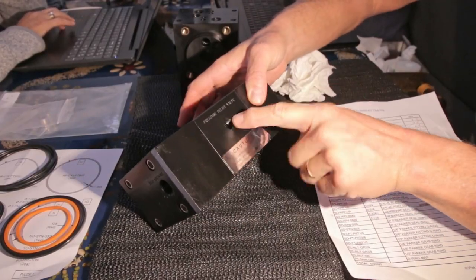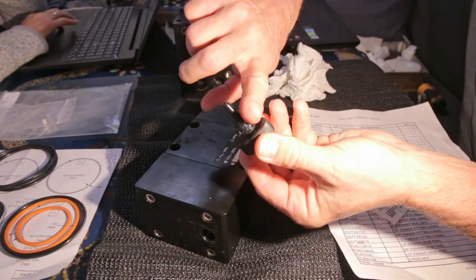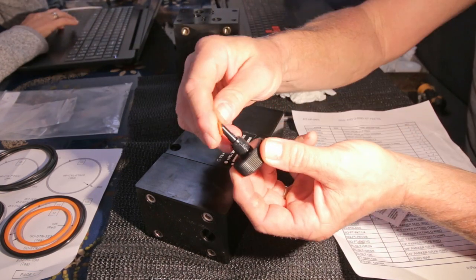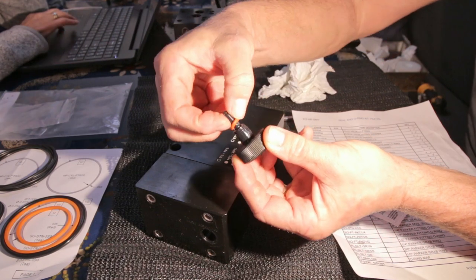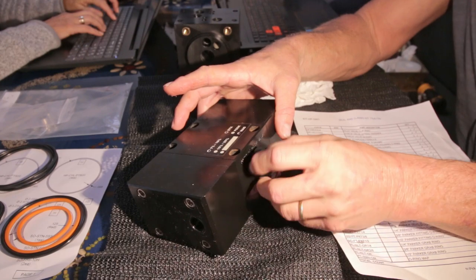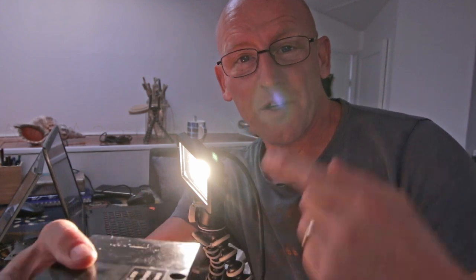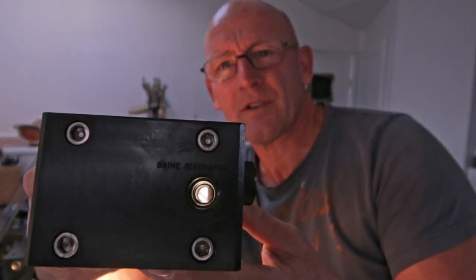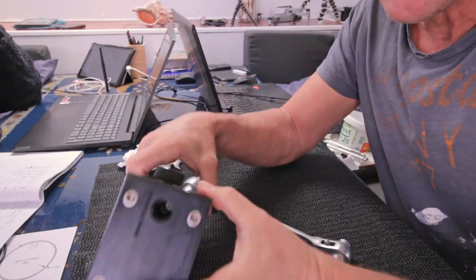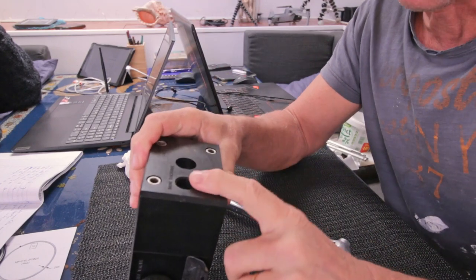So, and the last thing, pressure relief valve, this thingy. Put some grease on the thread and also a little grease on the tip. Put the seal on, screw it in, and then a little bit back so it's open. And by the way, if you really want to be sure whether you did it well, look into this hole. You can see right through it, so the holes are in line. Ta-da! Now you have two brine outlets on both sides, and you're just going to use one.